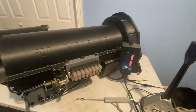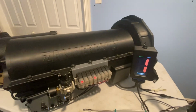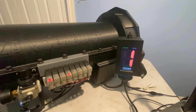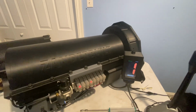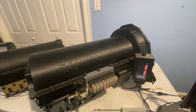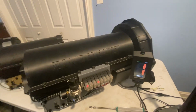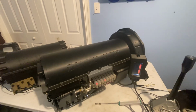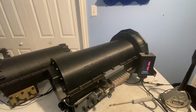This transmission also allows rapid downshift. So I had a guy message me, and he wanted to know if he could hook his brake switch up to this. So if he's coming in the corner in, say, 9th gear, and he wanted to downshift to 2nd gear, he could just push the brake in, and at a certain pressure, it'll just auto downshift to the lowest possible gear without over-revving the engine. And that's definitely possible with this.